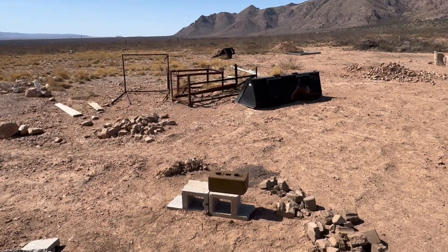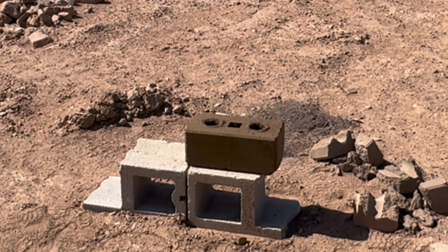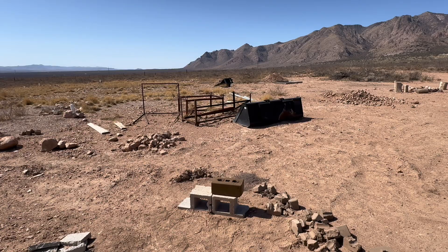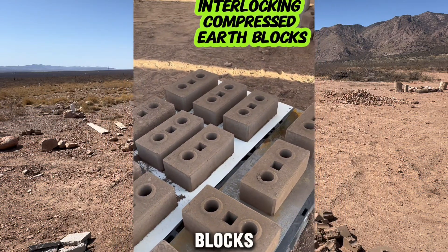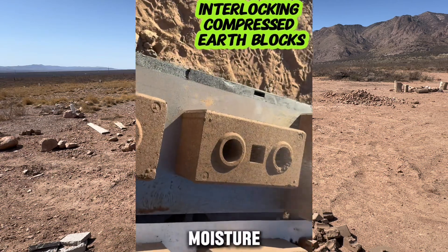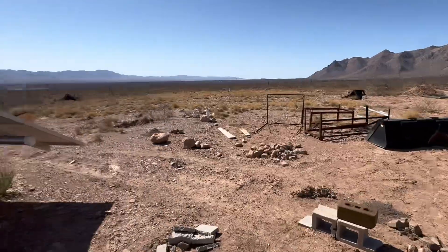This is just 10% cement — seems good. I think it's successful. We may not even need clay for that matter, really. But the only reason we might use it is for easier handling out of the machine. And we also have to master the curing process — misting it and covering it up and misting it for 14 days and so on.